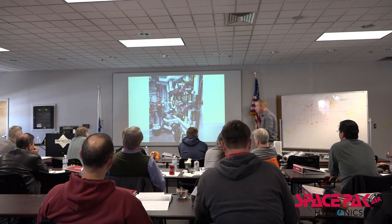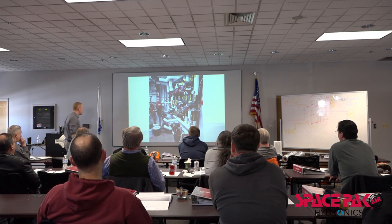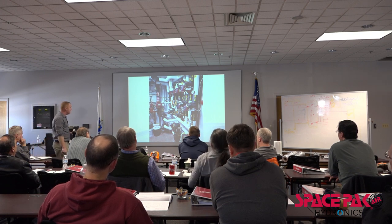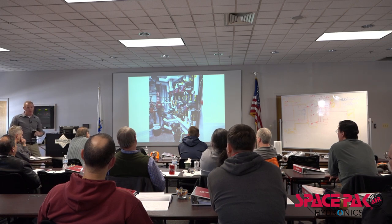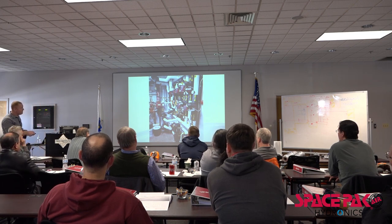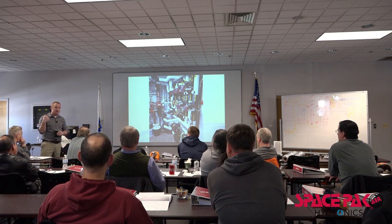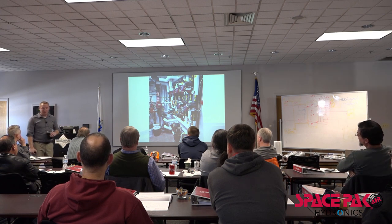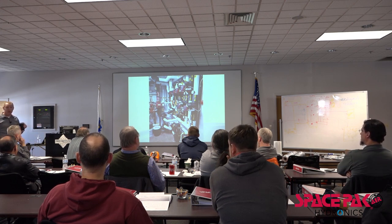This is the inside of that job in Maine where those units ran for a couple weeks in really cold, negative 20 temperature. This is a great picture of an overbuilt boiler room. It looks fantastic, but I wish I was the Grundfos salesman on this project. Those are the two pumps going to our units outside. Remember, we only need 10 to 12 GPM. Those are capable of like 30-some GPM, and they're fancy pumps, but it worked fantastic. They spared no expense, and it works exactly the way it's supposed to.